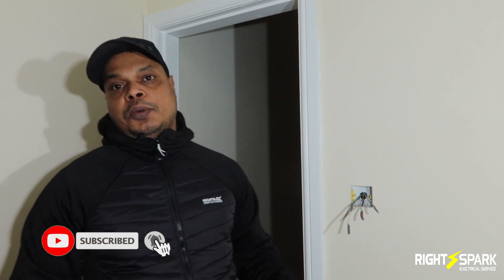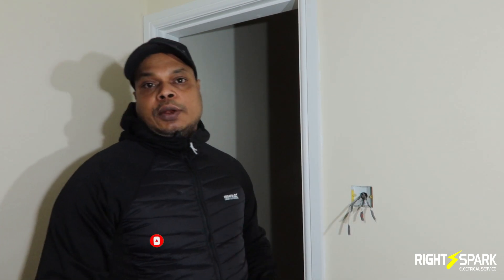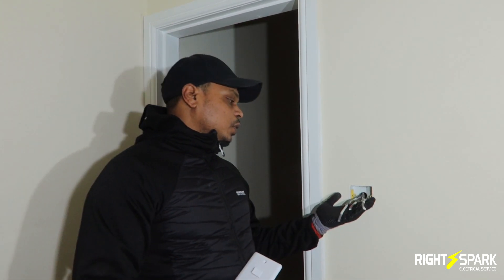It's a lot easier in the future if there's ever any fault, or when we're doing the testing — we can always come to the switch and diagnose the problems. It's a lot easier, especially in a bedroom or on the first floor. If there's a bed in the middle of the room and the light pendant is in the middle of the room as well, it's a nightmare moving the bed and getting the ladder up. This way is much easier.